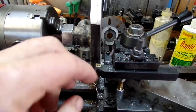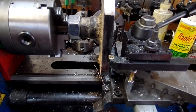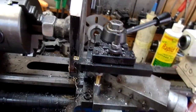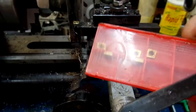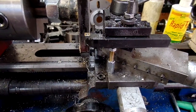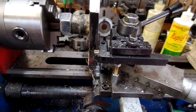The Banggood turning tool has a carbide insert tip. I'm about a quarter inch in. I don't believe it's quite as hard as other carbide tips I have — I'm not sure what the grade is, it's what they had to offer at a reasonable price. I've got two different turning tools that use the same insert, really not too bad. The other turning tools I've ordered from Banggood have been pretty good, but I just thought you'd like to see how you manage to handle oversized objects on a mini lathe.